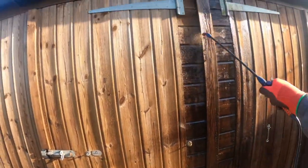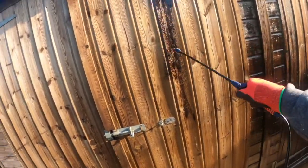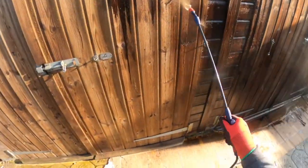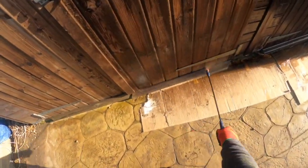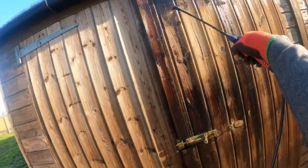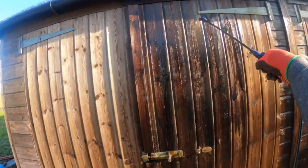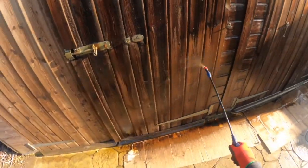If I don't set the nozzle too fine, as you can see, it's kind of drippy, but you won't avoid that anyway — it will run. I put some cardboard down there mainly just to show you to do it. Being oil-based and a dark stain, if you've got something porous like sandstone, it'll go straight through it. So definitely keep it protected and be well aware that it will run if you're using a sprayer.